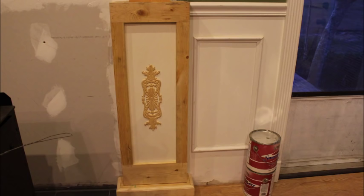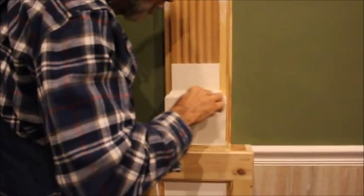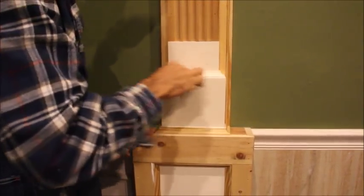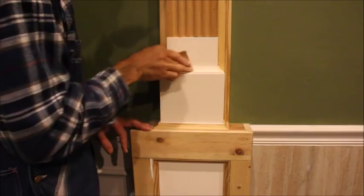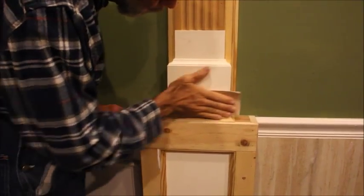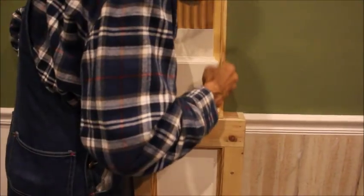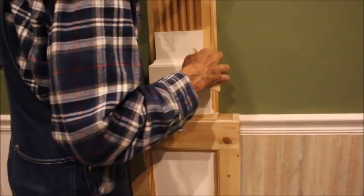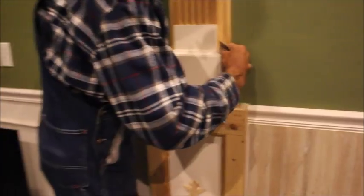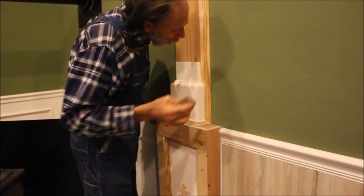You back off and look at it from a distance and you can kind of see what they look like now that they're finished. Now I've installed the cement board between the two columns and the chair rail on it. At this point I've refurbished some of the pieces that I took off the actual fireplace. So what I'm doing here is going back and sanding them, making sure that when I paint I get a good bond and there are no imperfections, because I did have to fill a few holes where the nails were when I took them out. Wanted to make sure we get all that back down and looking real good.